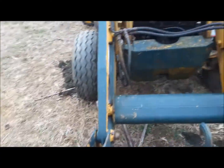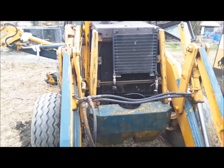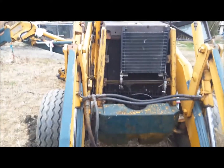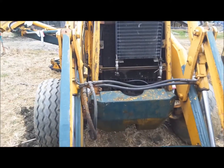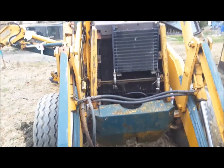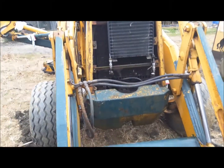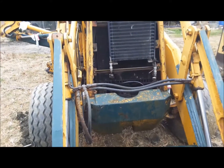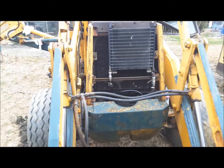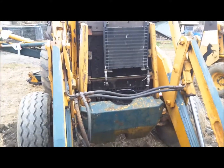Here you can see a radiator that originally came with a built-in hydraulic oil cooler. I added my own second one — the original one started leaking and I wasn't about to pay 400 bucks for a stupid radiator when all I needed was something I could get for about 50 dollars like this one. I did my own fittings and that solved that.